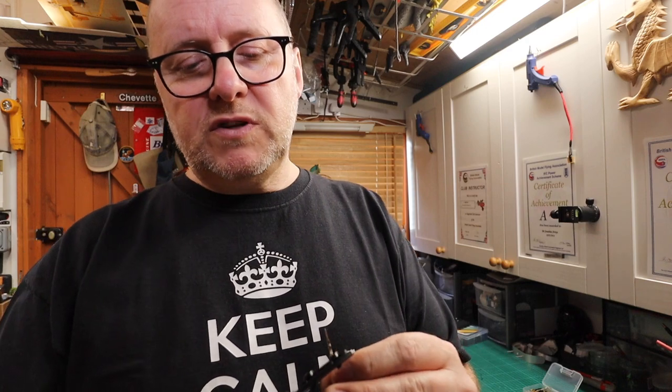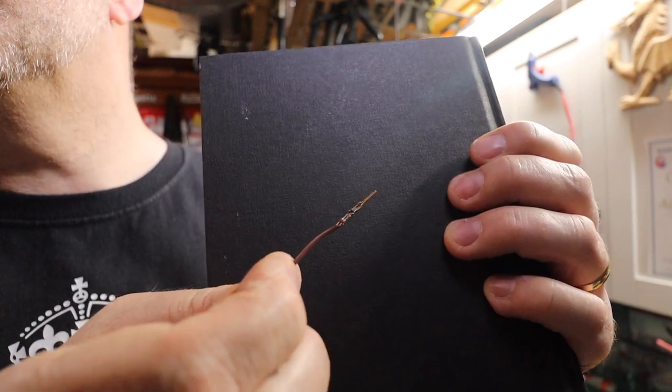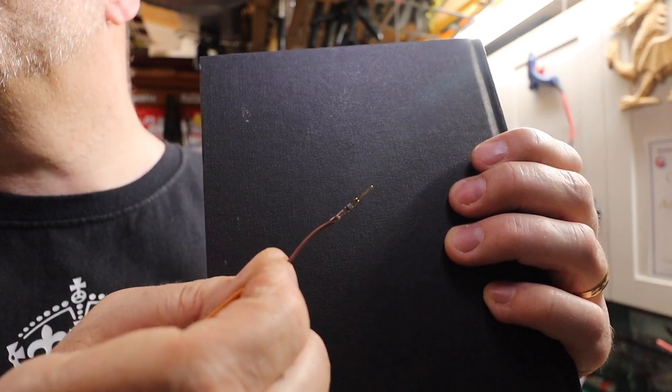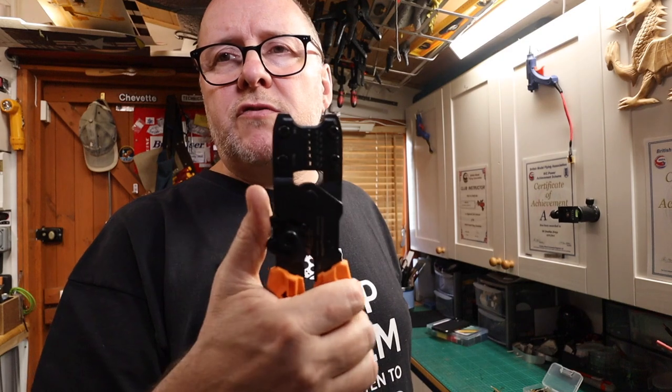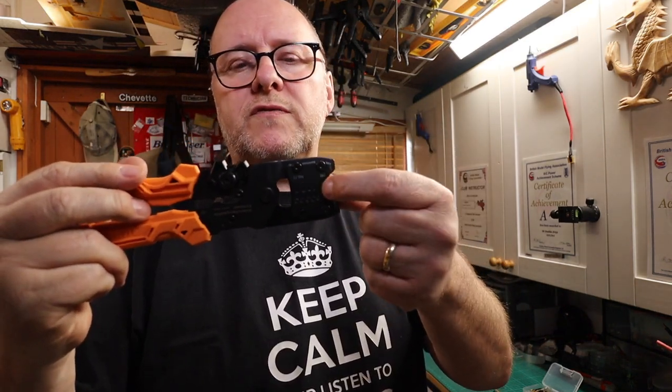Then you need to do the outer wing, which is the insulation. So you find the one that best fits the insulation and do the same. Hopefully you'll be able to see it's actually crimped into the PVC. This crimper has got lots of different options for different sizes, but you have to do them one at a time, which is okay.